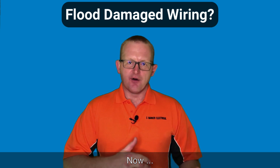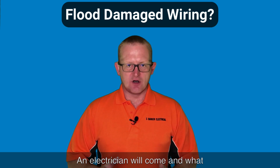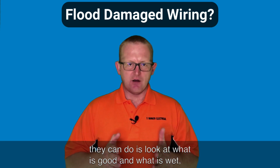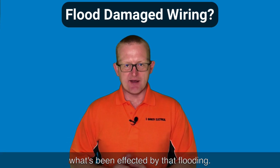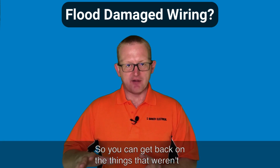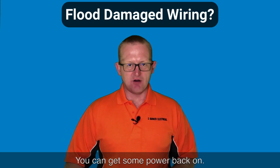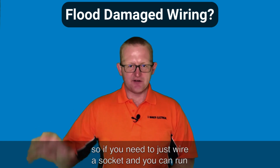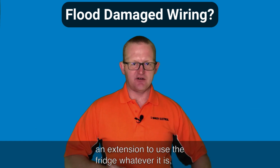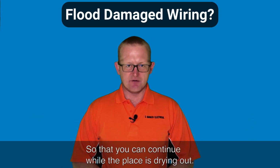Now, you need to let things dry out first. An electrician will come, and what they can do is look at what is good and what is wet, what's being affected by that flooding. So you can get back on the things that weren't affected by it whatsoever. You can get some power back on. If needed, you can get some temporary power. So if you need to just wire a socket and run an extension to use a fridge, whatever it is, get some temporary power in there so that you can continue while the place is drying out.